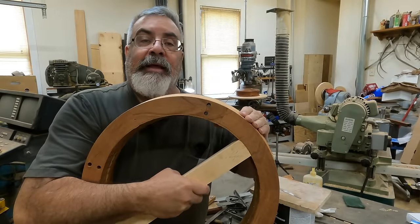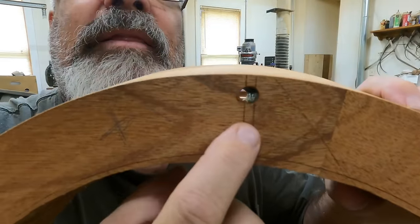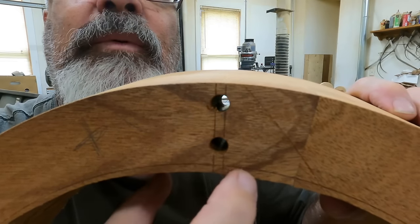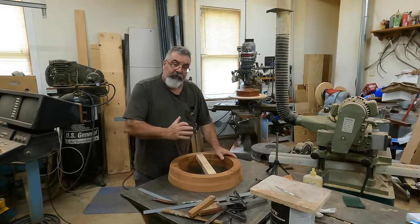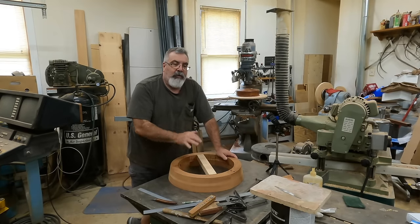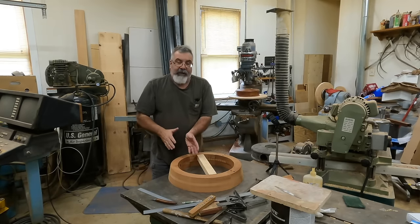I sanded off the draft on the outside of the core print, and here are the holes that I made. So there's my 3/16ths gap, and I'll be able to locate with these holes and a piece of dowel that'll locate perfectly back together when I put this back. That's why you do it like that. I am going to pour plastic. The goal is to get a quarter, that true quarter piece, and then get the pattern itself mounted on the board that we have — remember that board we cut out.